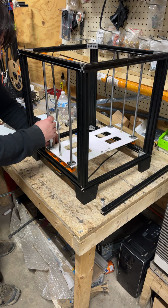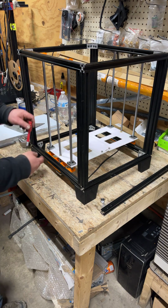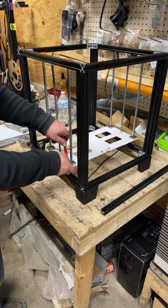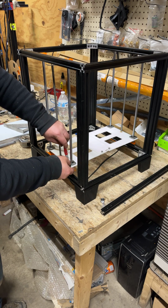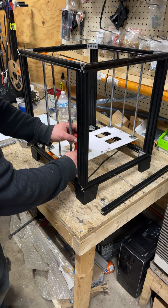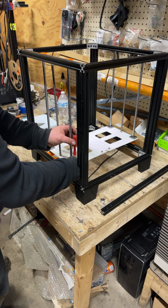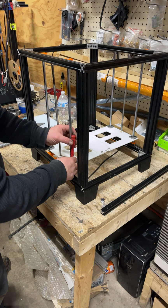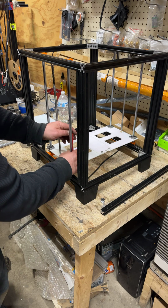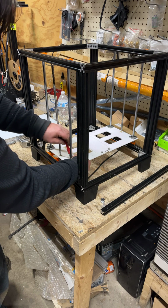These don't have to be hugely tight in this step. I mean, you will want to tighten them up a little more than I'm doing now on the actual build plate. And the reason why we're tightening these now is because they're going to be centered on the shaft down bottom here. And if they float when we pull out this lead and test the up and down travel, just to get an idea if we're going to have much bind, we don't want them floating because we won't feel any of the bind we would have had.